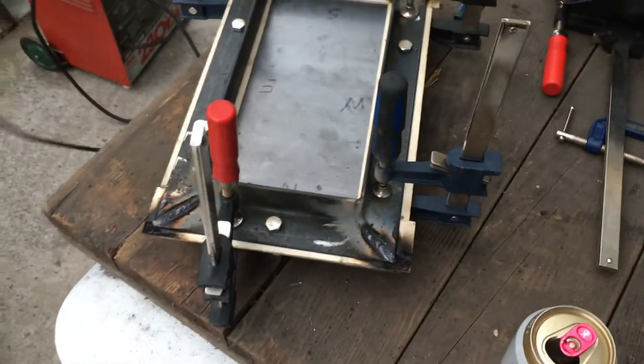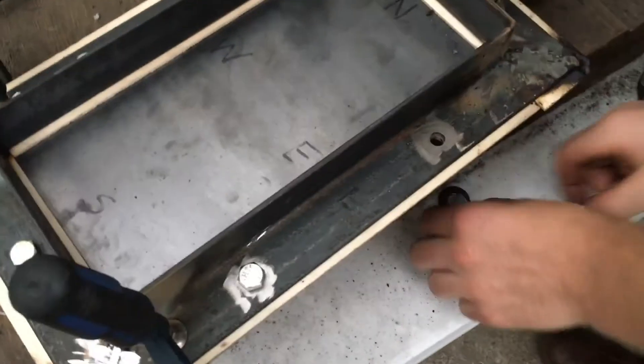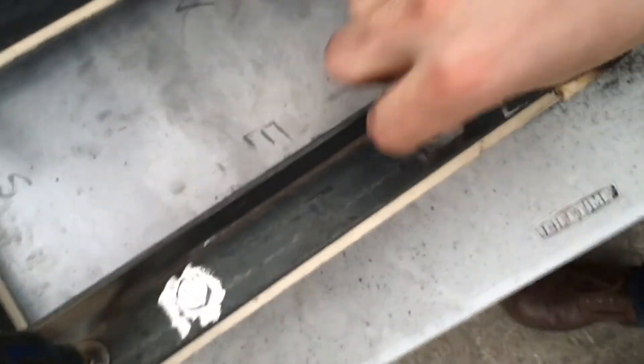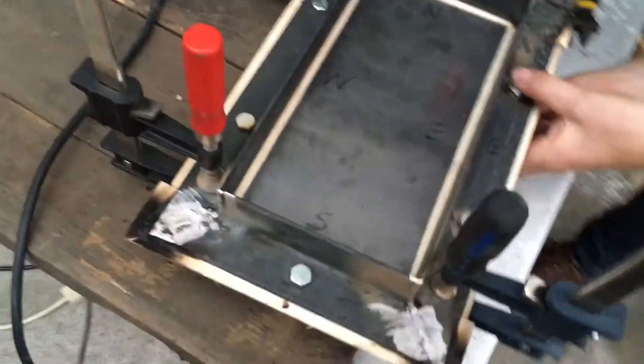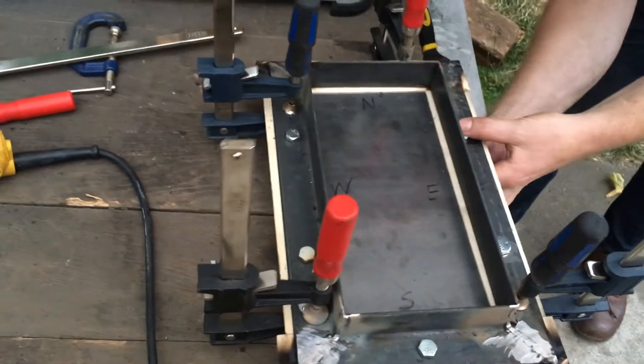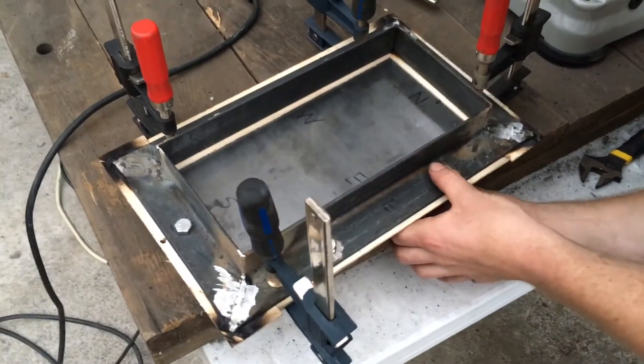We have a bunch of through bolts going through there, and looking at it, it's probably gonna be a pretty good seal — but we did say that about the last door that we made. We got all the corners welded and that's looking pretty good. Tacking these bolts down, cleaning up the spots right next to them with the grinder. We want to make sure the whole thing stays super flat while we're welding on it so that the seal stays good.